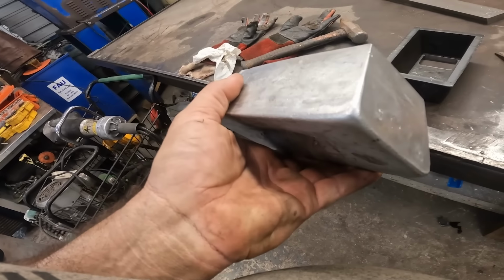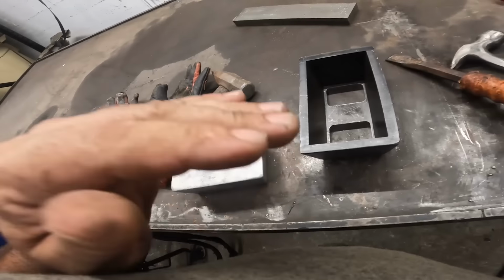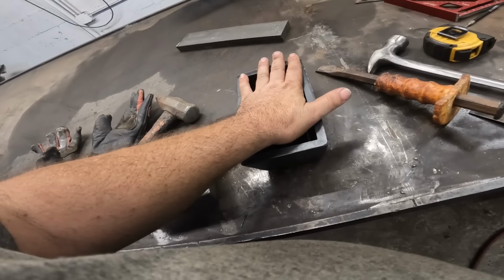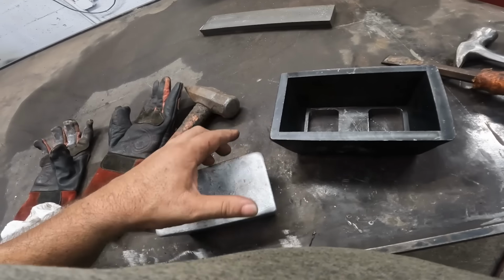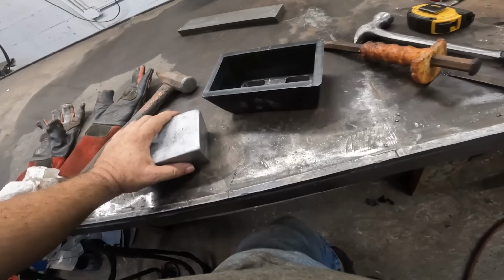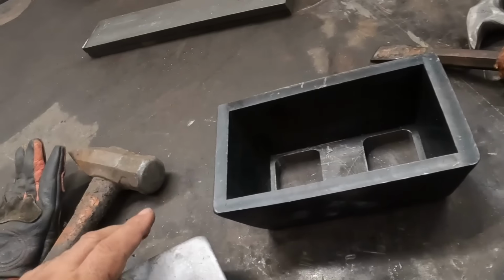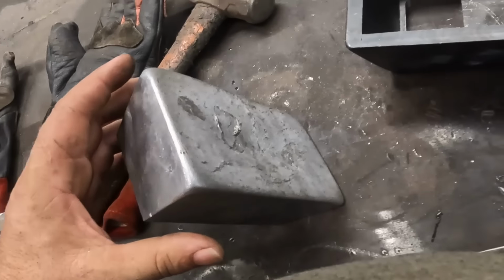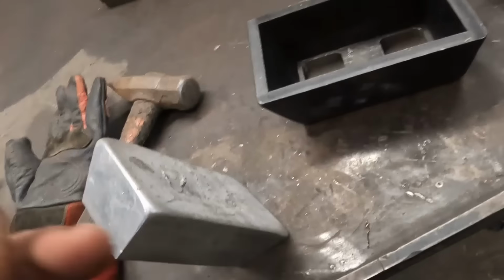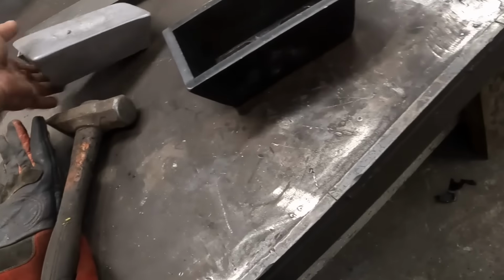but we got to get rid of all these imperfections, and we're gonna have to come up with a way of double heating these molds, maybe even put them in another kiln to keep the metal molten so everything settles. We'll figure it out. It's a work in progress. I'm gonna hit the time lapse. We're just gonna blow through this real quick and get this thing done.